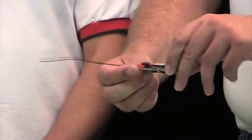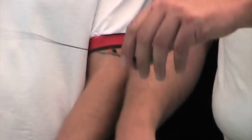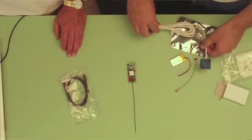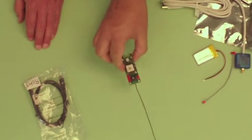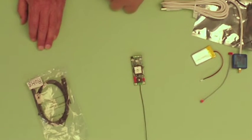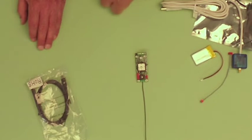Another neat thing you can do is turn the electronics on while the rocket's horizontal, then — particularly if you have a large project — load it on the rail, turn the rocket vertical, and then without having to climb up on a ladder or tower and monkey around with a screwdriver trying to turn switches, you can come in over the radio link and tell it to recycle itself and go from idle mode into pad mode, ready for flight. We think that's physically a lot safer because you don't have people standing on top of stepladders. There's a lot of neat stuff that happens as a consequence of having the radio link and GPS on the board, and fitting all of this on a board about the same size as a lot of simpler dual-deploy altimeters makes this a fairly exciting thing to fly.